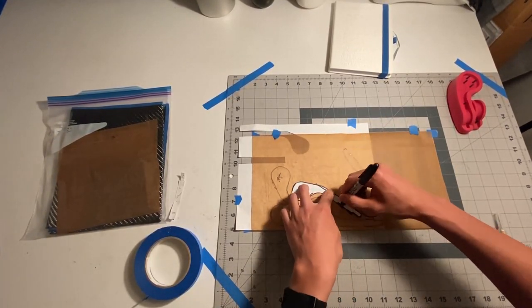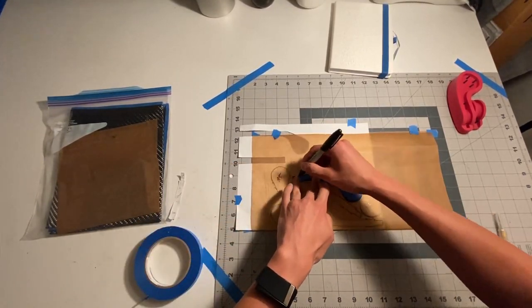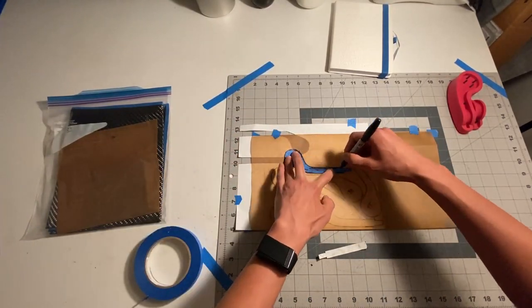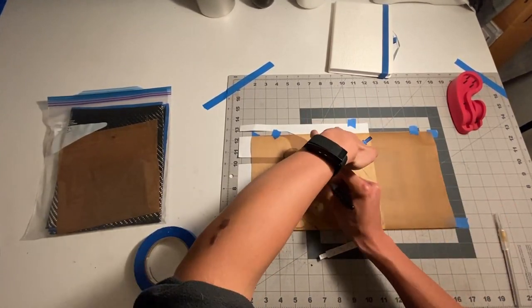The direction of the carbon fiber strands actually mattered. We get higher strength in the direction of the strand, so to get better torsional strength, I angled some pieces 45 degrees so that we have a combination of 90 and 45 degree running fibers.